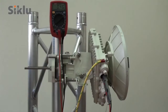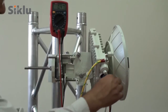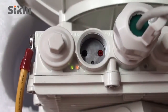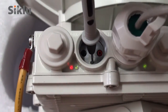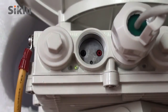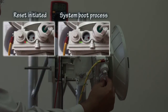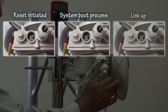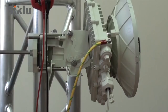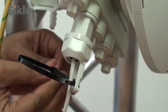Use the voltmeter to verify that the RSSI has not changed after locking all the bolts. Once the antennas are aligned and locked, disconnect the voltmeter and reboot both local and far-end ODUs by pressing their respective reset buttons. The ODUs will revert back to adaptive mode, which is the default operational mode. The RF LEDs on both ODUs should illuminate green, indicating the link is up. The radio link can now pass traffic and management between all ports and over the radio.